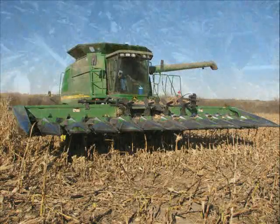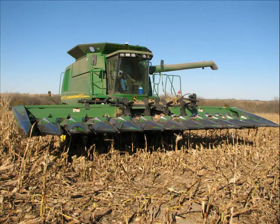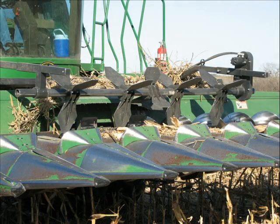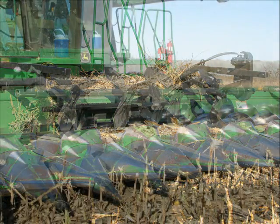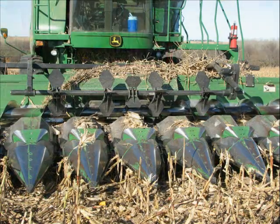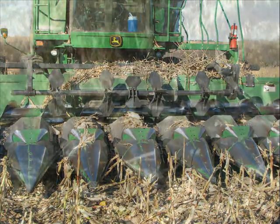Here you will see the Hawkins Corn Reel used as strictly a fluff reel. This fluff reel is built from the center section of an expandable 4-row package. The built-in reel tube coupler allows expansion of this package from a 4-row to an 8-row or a 12-row.